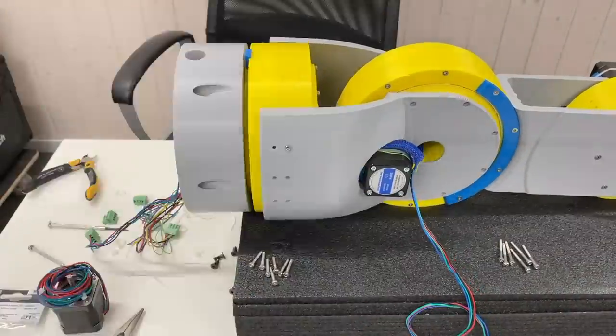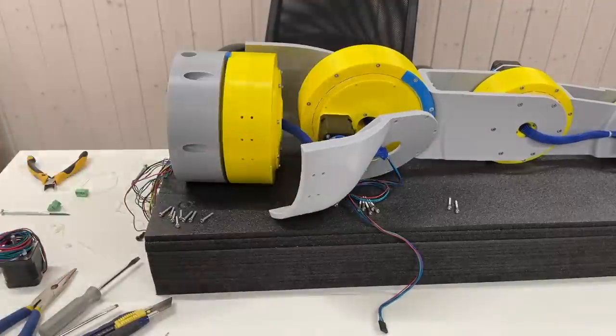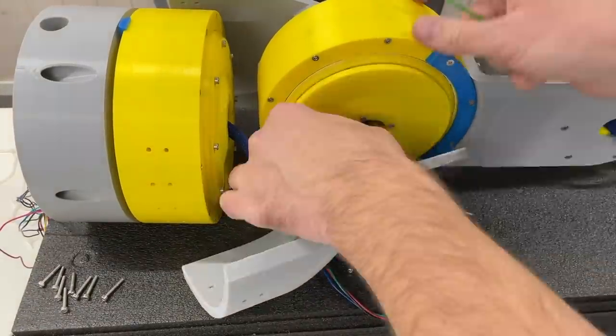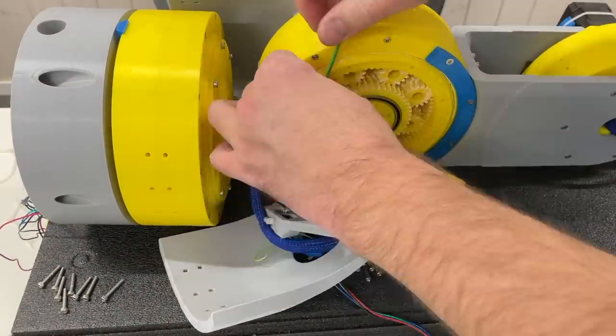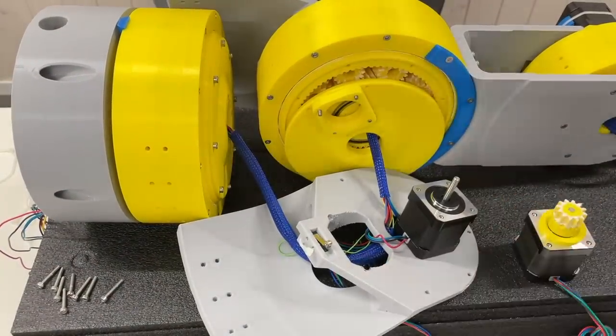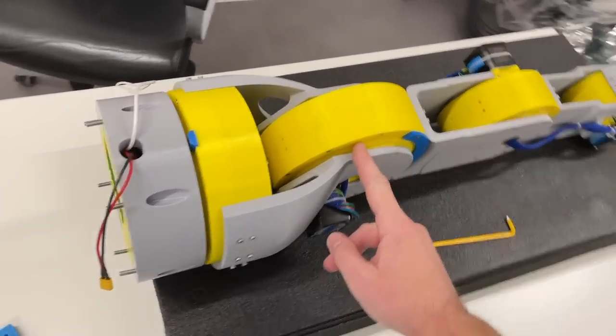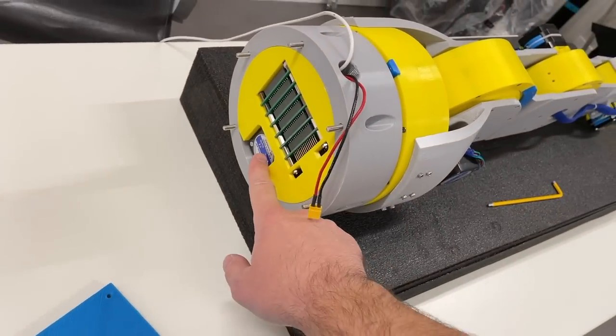And I continued with the shoulder motors. Again it was possible to change these motors without desoldering limit switches and thermostats. I have not filmed how I reassembled this shoulder with the new motors because it's basically the same just in the reverse order. I have replaced the motor on axis 3, the motor on axis 2, and on axis 1.